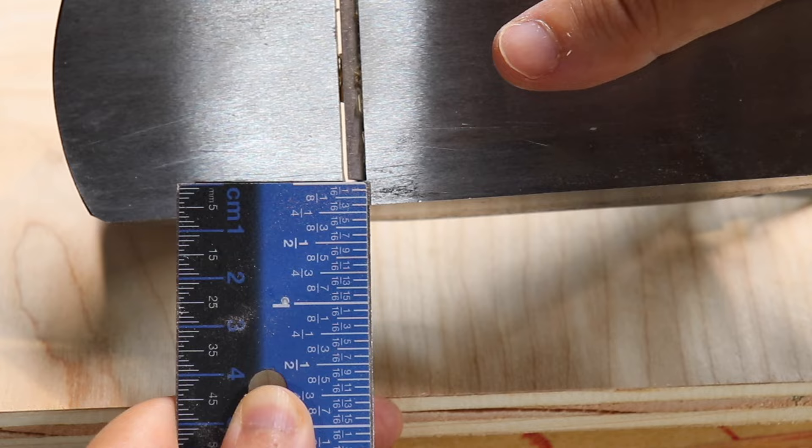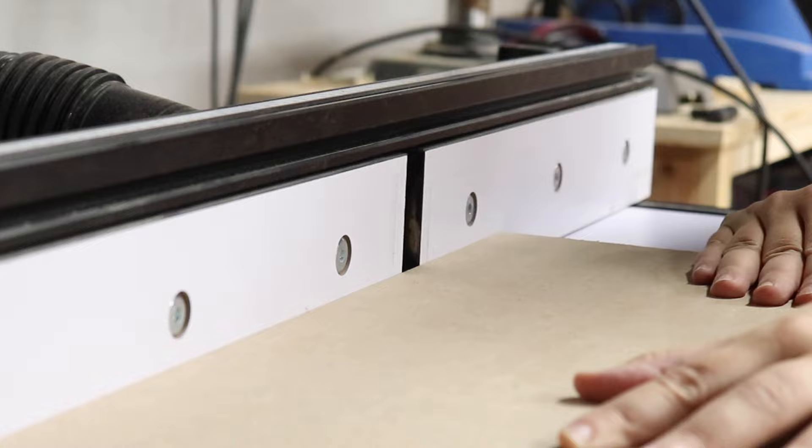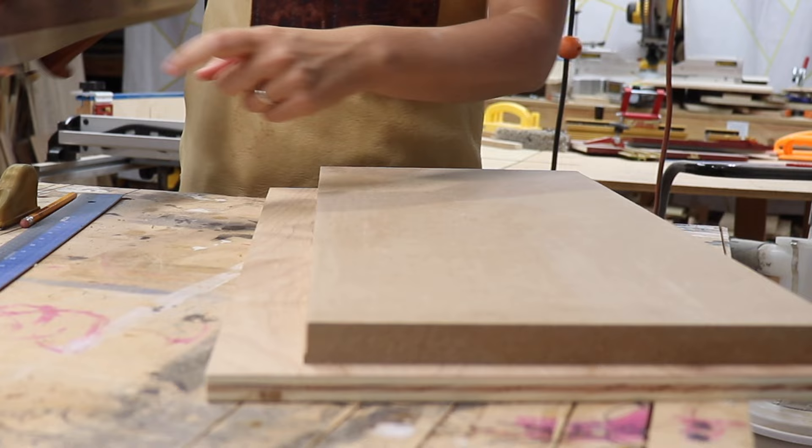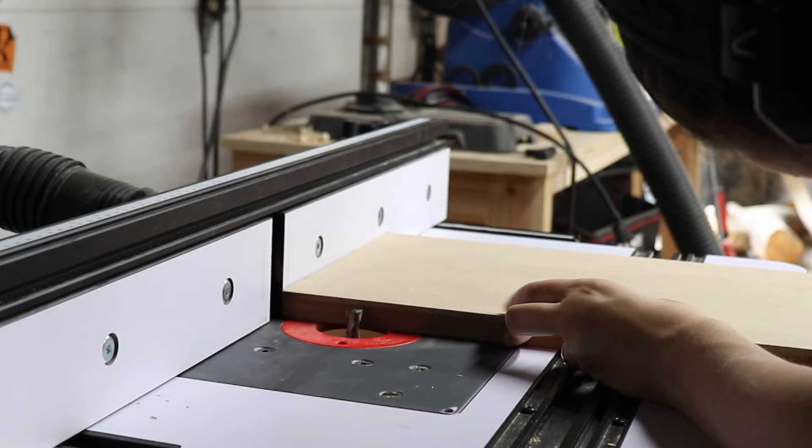Here's a tip I learned from Rob Kosman's shooting board video — I'll put a link below. He creates a tiny little rabbet on the edge of the top portion of the shooting board. This prevents the plane from eating away and messing up that edge. The bottom of the sole always rides up against the part that's sticking out, and there's a tiny little gap that prevents the blade from chewing up the edge of the shooting board.